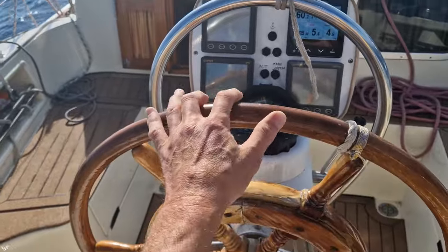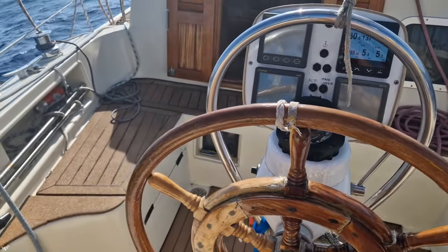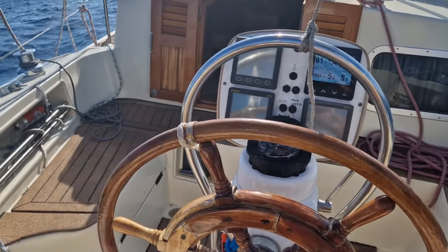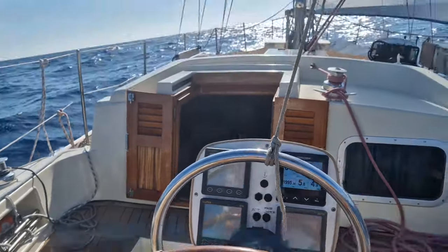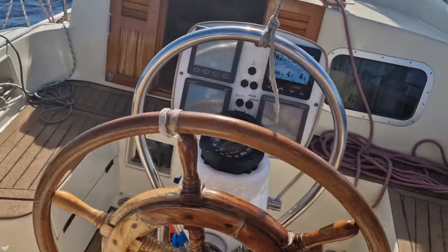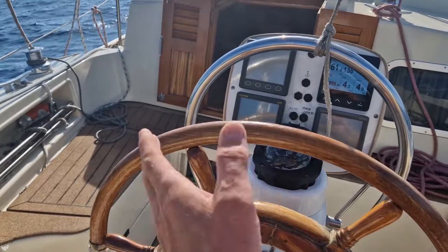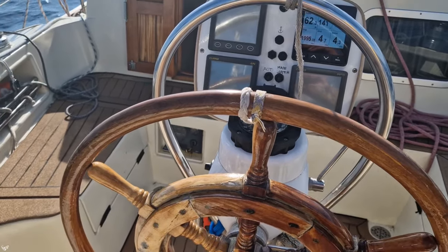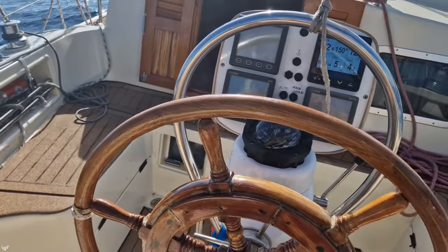This is roughly the middle in my case. Boats generally have the tendency to go to windward, but I leave it alone and as you can see, it runs by itself. It turns a little bit — a little bit more to windward — which means we have a pressure to windward, but it's really not much. The boat steers a straight line, going a little bit forward and backward. My steering wheel has three turns from full rudder left to right, so that's actually not really much.